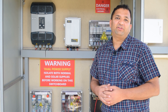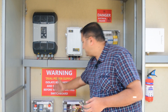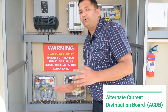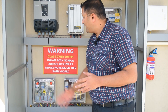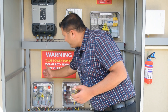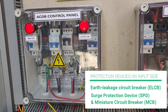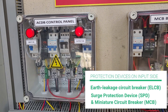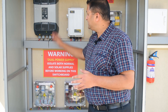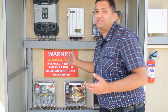You just saw the different topologies and configurations under which the hybrid inverter can function. This is the ACDB, or alternating current distribution board. This houses both the input and output side. This also takes the input from the grid. On the input side, we have got certain protections like ELCB, SPD, and MCB. On the output side, we have got a changeover switch, an SPD, and an ELCB. The conditioned power from the inverter gets into the load through these protection devices.